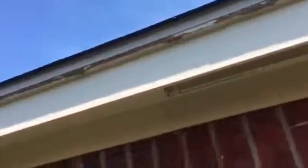These are the areas that have already been power washed — that's why I'm showing you that. Very important to notice that wood up there, that 1x2 drip edge — it's been power washed. All of that will be primed. You'll see primer on 100% of that drip edge right there before this house is painted.